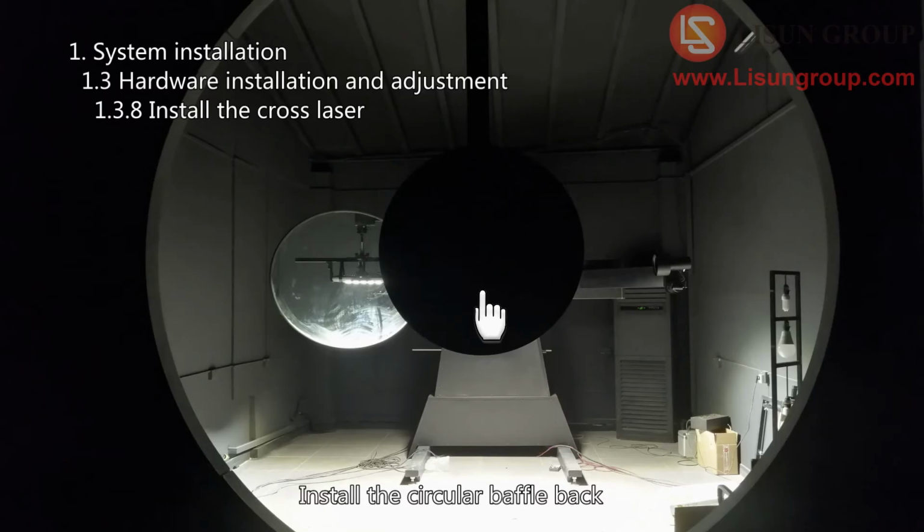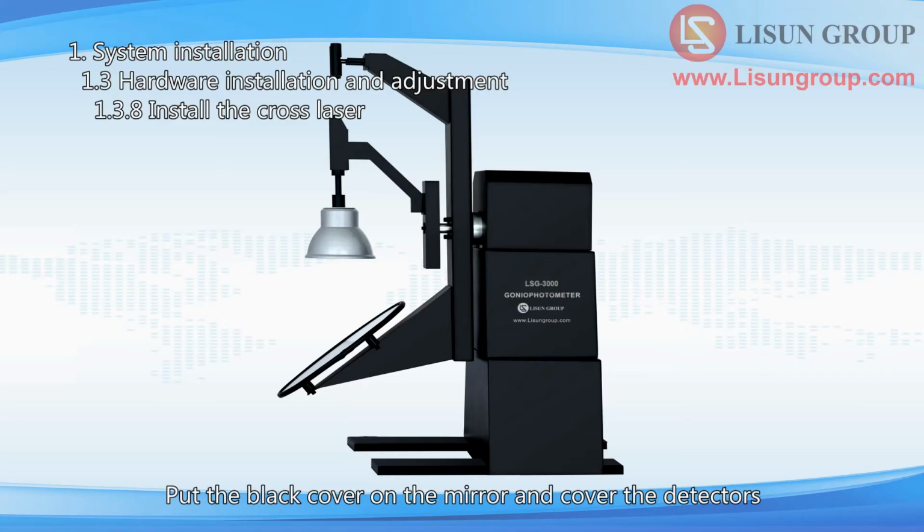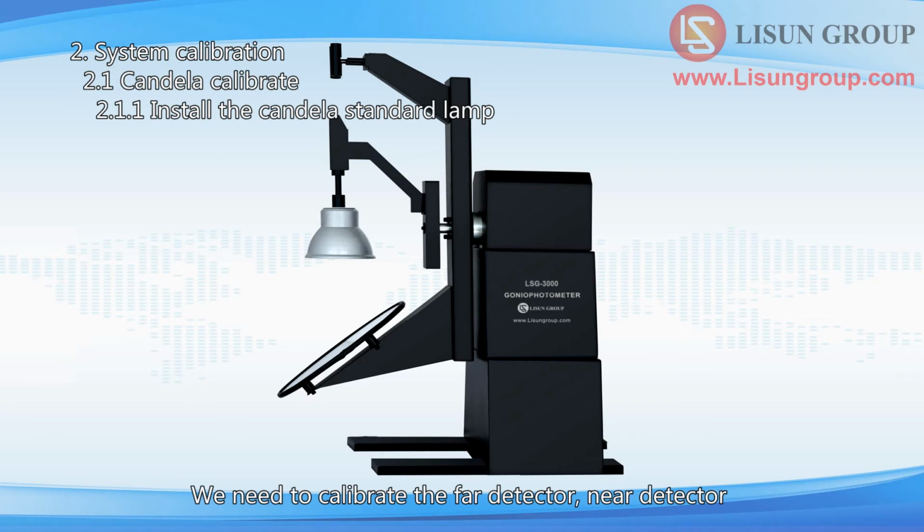Install the circular baffle back. Put the black cover on the mirror and cover the detectors. Clean the darkroom and wipe the machine. Then remove the covers. We need to calibrate the far detector, near detector, and the spectroradiometer before measurement.